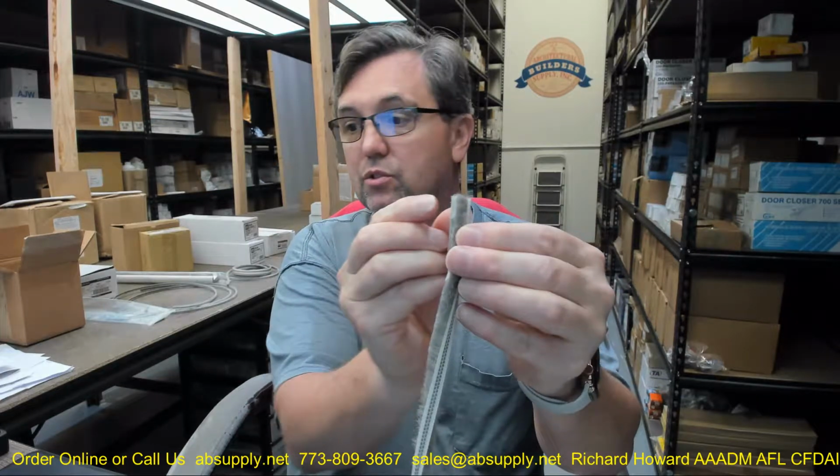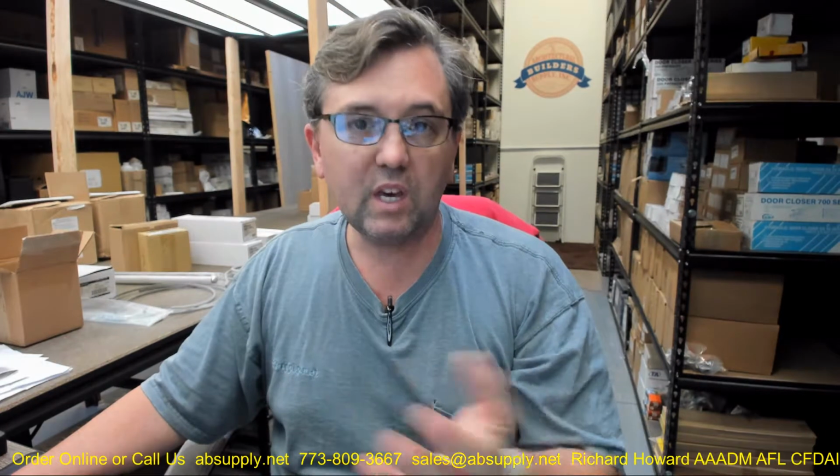Then scroll down to the bottom third of the page and you're going to see all of the related fin pile only, where your backer is going to stay the same, but then your projection is going to change, okay? So the key with the extrusion, the DS369, make sure you've got a .270 wide backer and it's going to fit in. But you can see other backing widths that are there as well that may suit the application that you need to work on.